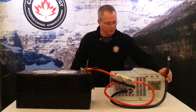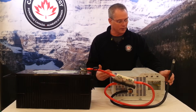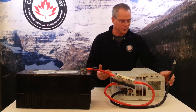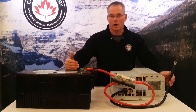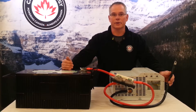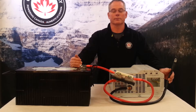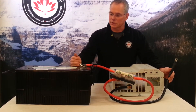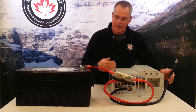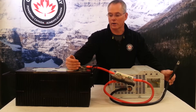For demonstration purposes, what I want to demonstrate here is what's going to happen the first time you hook up an inverter or inverter charger. I'll caution you on one thing: you do not want to pull a battery off of the charger and attempt to hook it up to an inverter charger or an inverter immediately. When I go ahead and attach the negative cable for the first time, it's actually going to arc, and that's normal.